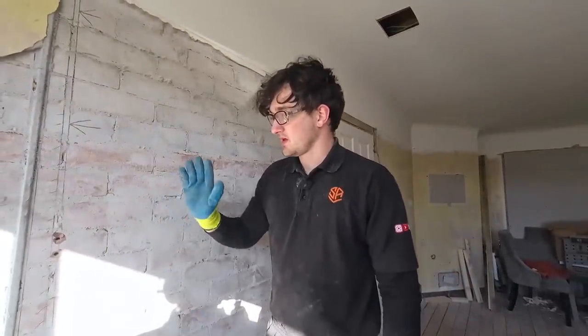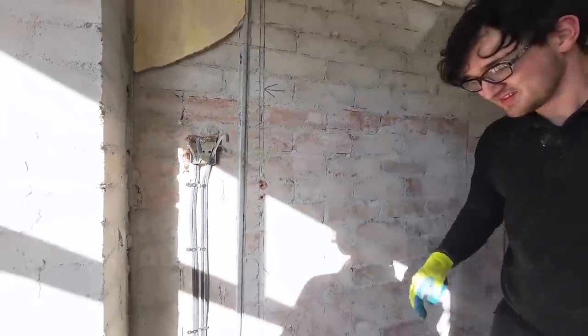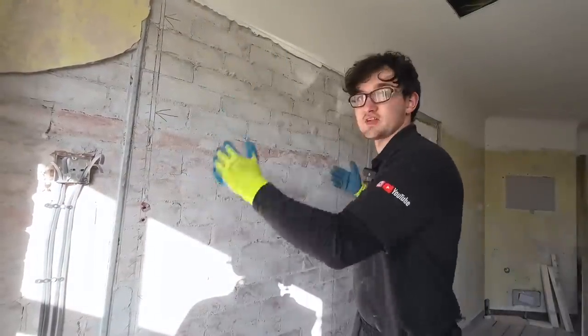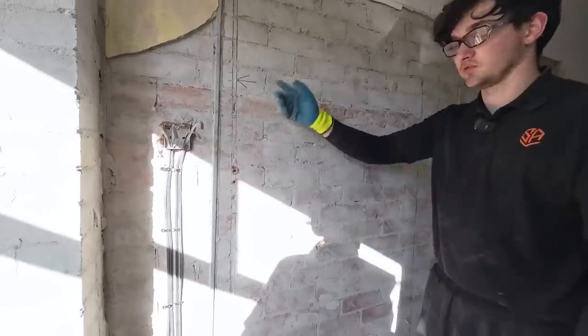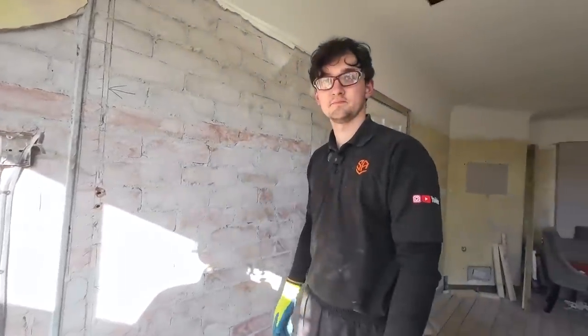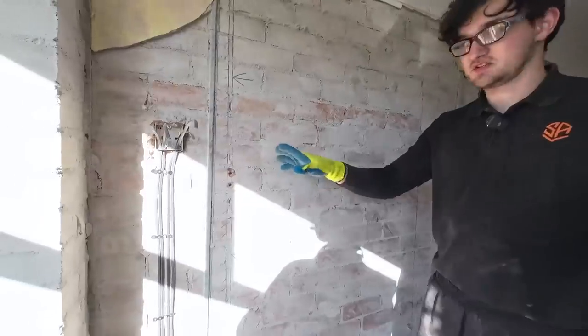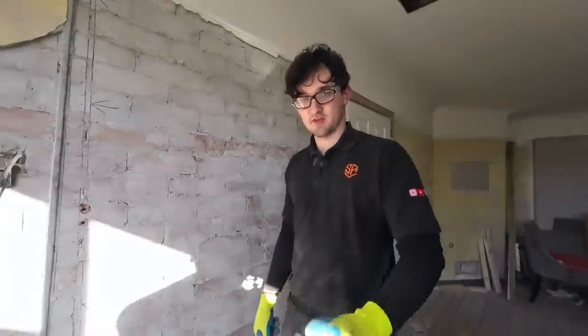So, for the most part, it's quicker as well. Sometimes. So we'll continue just doing that. And then once all that stitch drilling is done, we just simply knock out the broken halves and full bricks that will come out with it. Simple as. So that's a little rundown of what stitch drilling is and why we do it, especially on inside jobs. Thank you very much.